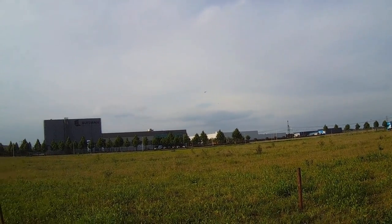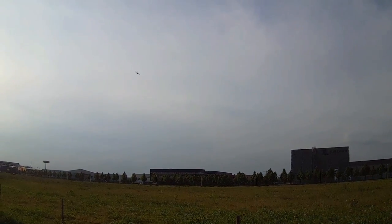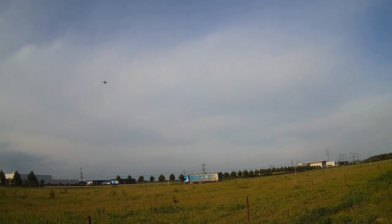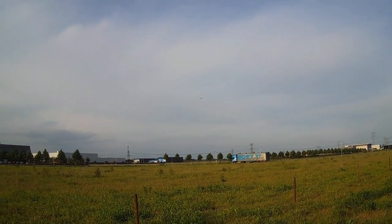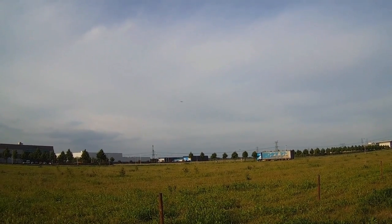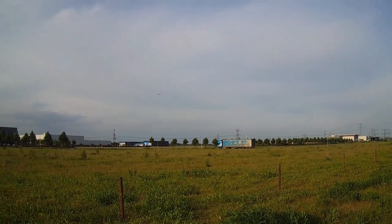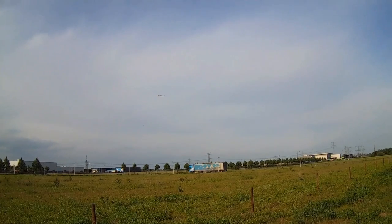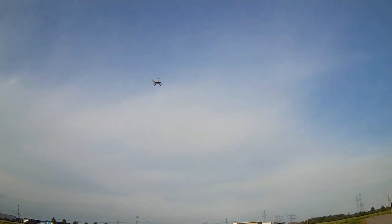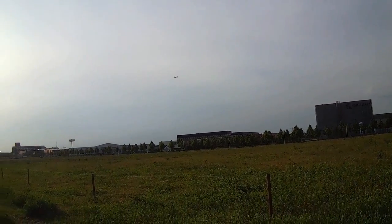This isn't the standard configuration of the APM quadcopter firmware — I think they are 45 degrees as standard. I've changed those to 60 degrees. Once again, this is intended to be a sports flyer so I want to be able to bash it around.